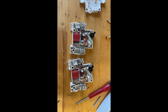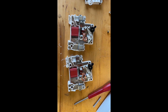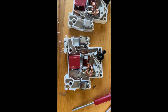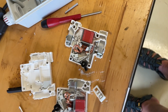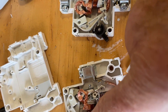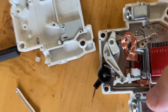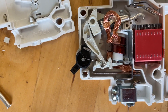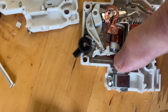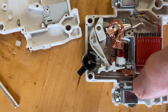As Will Prowse says, these breakers will function as a DC disconnect for lower amounts of power. There's a fair amount of tech in here. It shows me that whoever built these knows what they're doing. It's not some fake — it's a nice piece of equipment, but don't use it beyond its rating. This looks like a bimetal strip, so this breaker trips both magnetically and probably on overheating that strip.